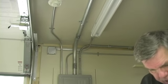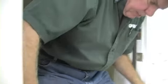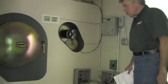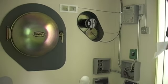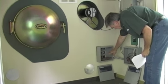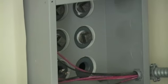As far as the GARN unit is concerned, we'll go back to the other side. Before you install or fill the GARN unit with water, you have to install 3 electrical elements in the off-peak electric box. The bottom 3 holes were left blank, left open.